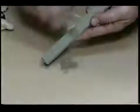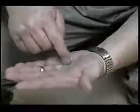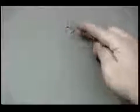First, you need a scrap of the material used so that the color matches. Using your utility knife, scrape along the surface, creating fine particles. Once you've scraped up enough for your repair, you'll need some white Elmer's glue and mix it together with your scraping, mixed well enough to form a putty-like consistency. Take your finger and press the mix into the dent or gouge and smooth it out. You can also use a putty knife for smoothing. Once it's in place, use a damp rag to wipe off any excess and clean around the area. Good as new.